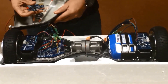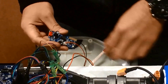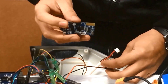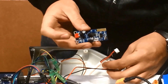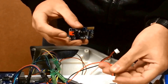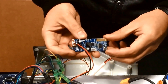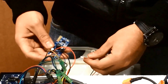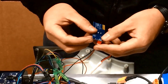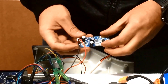The Bluetooth board is on the bottom casing — it's just a small circuit board. You'll notice there's a red plug and a white plug. The red plug is for power and connects directly to the motherboard. The white plug is your speaker output. Make sure not to connect the power into the speaker output, as this will damage the Bluetooth board and possibly the motherboard as well.